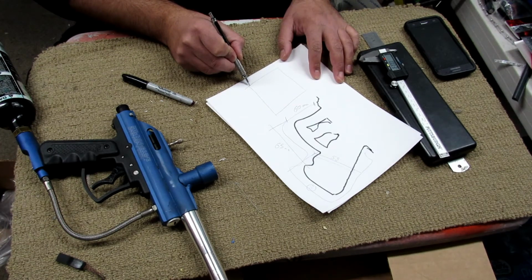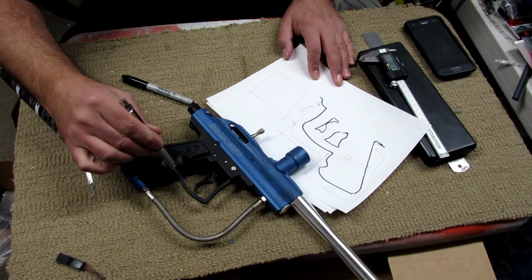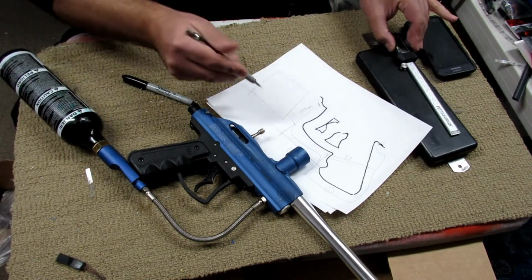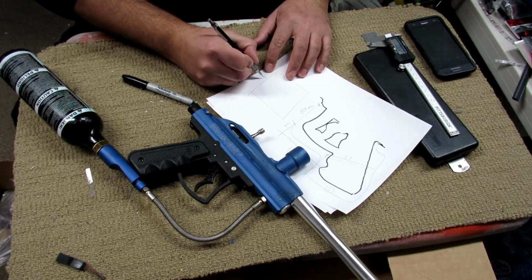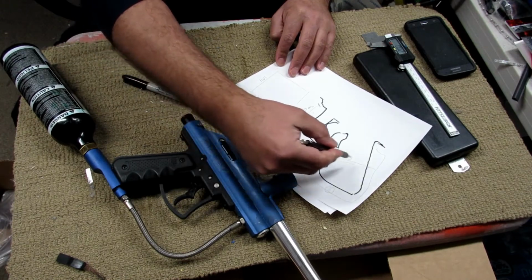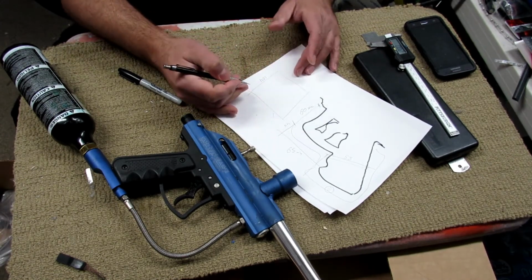But if you add that 60 millimeter, you're going to see that it's a little bit taller than that. One calculation that I did not take into consideration when I did it was the space from here to here. So let's measure it real quick. It is 44 millimeters, so I'm going to add 44 here. So what I'm going to get right now is 104 millimeter for the box. I have to add 65 and 53 in order to create the length that I'm going to have here, and this will give me the square that I'm going to start working with.